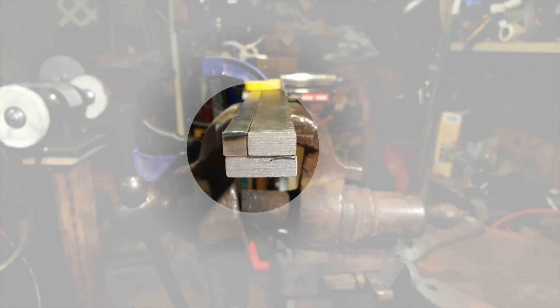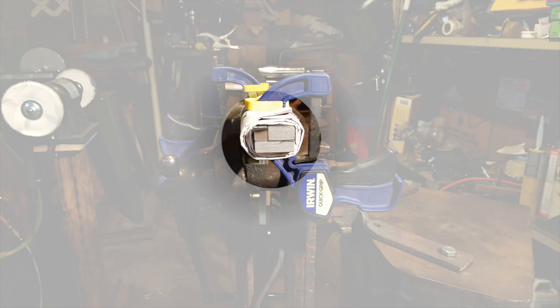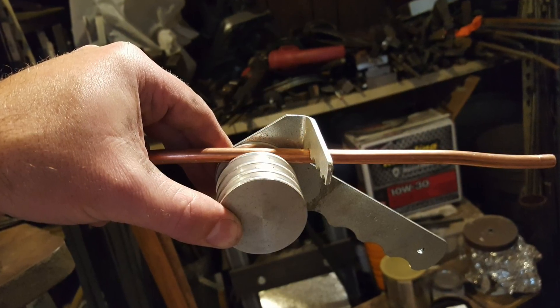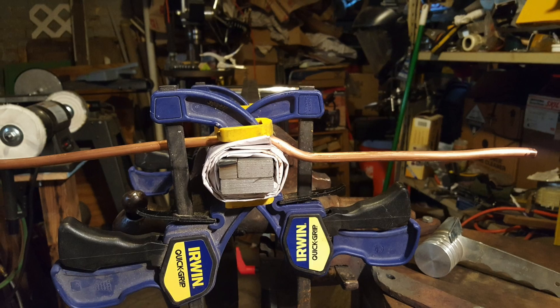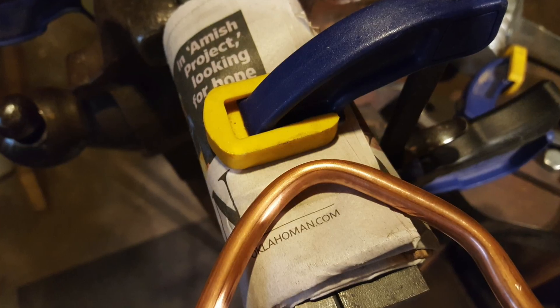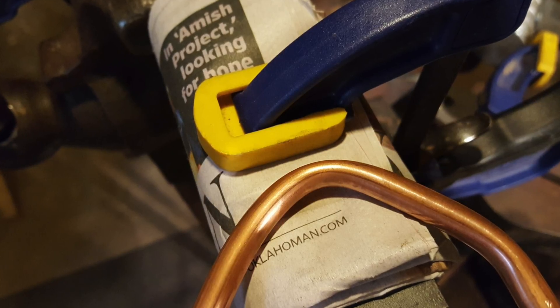I only had one piece of 1.5 inch by 1.5 inch stock, so I added some 1 inch by 1.5 inch and 1.5 inch square pieces to make a mandrel for bending. I needed the mandrel to be proud of the nominal 1.5 inch by 1 inch, so I folded up newspaper and added it as a wrapping. This coil is made with 8mm tubing. Instead of pre-cutting, I wrapped the coil and then cut it from the tubing spool. Using my bender, I bent a 45 degree angle to lead into the coil, then bent 45 degrees the other direction to start the coil, clamped it into place, and bent at 90. This bend in particular flattened too much for my taste.